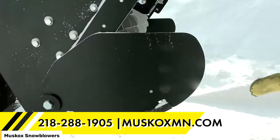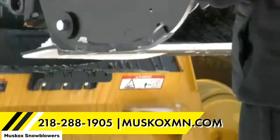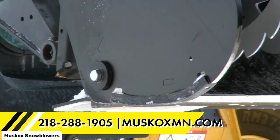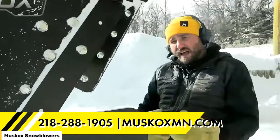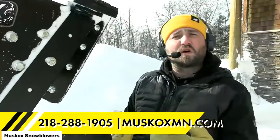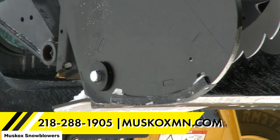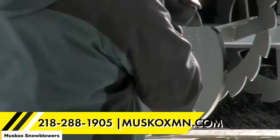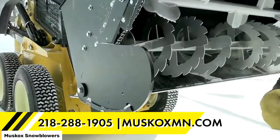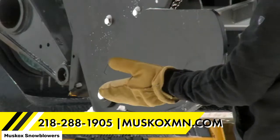So if you guys saw our first prototypes when we came on YouTube and we were testing out this idea, we did not have these side fins on it. We added that when we started making production models with our 2178 model, and have continued it with our 2278 single and our 2278 dual auger machine. So it's a side fin. As we're moving forward with the machine, the reason we stick out farther with this is so that we hold more snow inside the blower. That allows us to increase road speed. A lot of you guys I talk to, you're trying to get from one job to the next job to the next job faster. You're looking at improving road speed. This helps with that because we're holding more snow inside the machine.